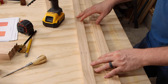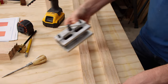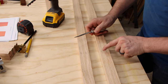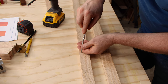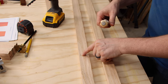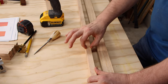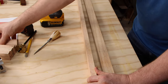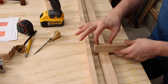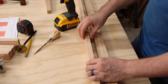The holes for the supports are perpendicular to the edge, so the doweling jig won't help here. I've got a crosshairs mark on each one and I'll take an awl to start the hole, giving the bit somewhere to begin. These holes won't be as deep as the others — only 3/8 of an inch — since we're not as thick here. The supports need to be an inch and an eighth deep since most of the dowel goes into the support. I'll mark that with blue tape and drill by hand.